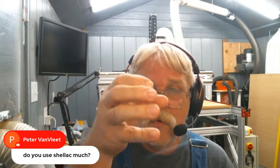Peter Van Vliet wants to know, do I use shellac much? Yes, I do. I like shellac very much. Now it has its place. If you've ever seen white rings on a table or coffee table, you know that shellac does not like to get wet. And when somebody says use a coaster, that's usually why. It is a good finish. It's a great finish. Who am I kidding? But it has its place. And I usually, for tabletops, prefer something else. I'll go with some type of a varnish rather than a shellac.